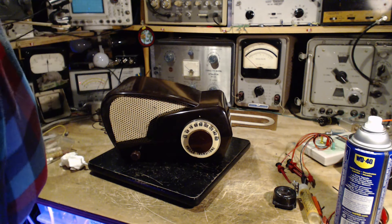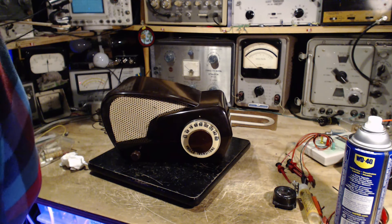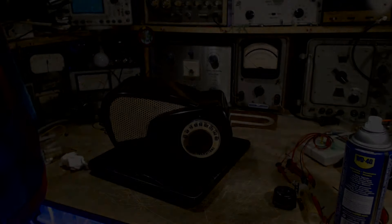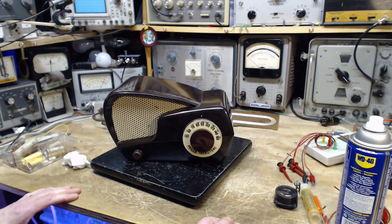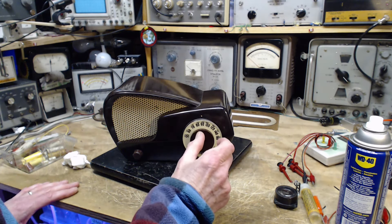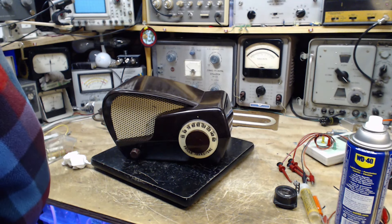Bottom line: radio working good — excellent. Very happy with that. Looks good, works good. Another radio is coming in tomorrow, another five-tube radio, so fantastic. Thanks a lot for watching the series. Oh — one last thing: the intermittent failure where the radio went dead for a while and then came back. I found I had not soldered a particular capacitor properly — in fact it wasn't soldered at all. That was probably the cause: it came off the terminal briefly then made contact again. So that won't be a real ongoing problem. Okay, that's it — bye bye.